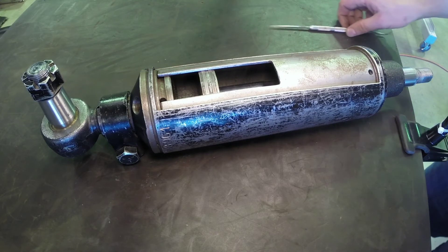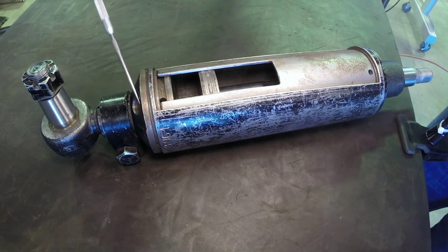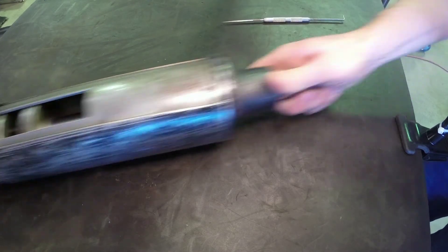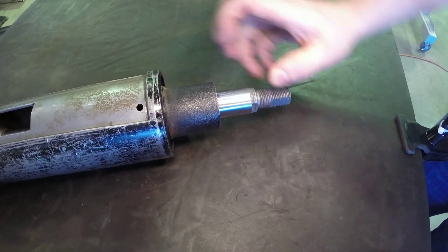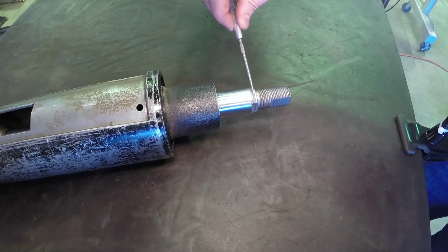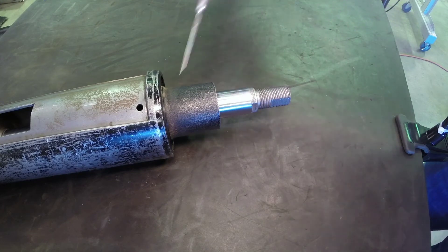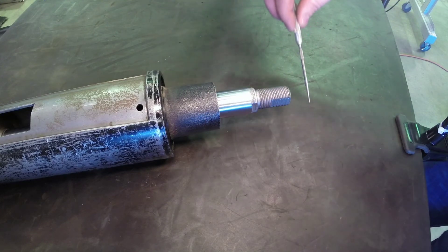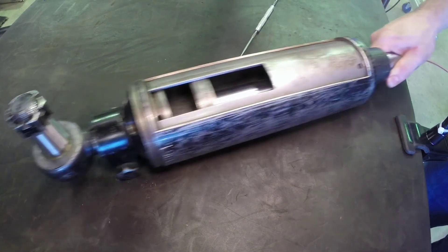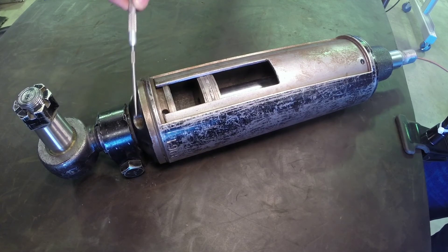This design is commonly used in steering so that hydraulic hoses can be mounted inboard on the axle, while the outer end has the tie rod end that connects to the steering knuckle mounted outboard near the tire. This gives the area around the tire the simplest end of the cylinder, rather than the hose end where rocks, dirt, and debris could cause damage.